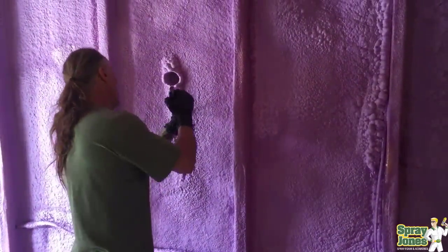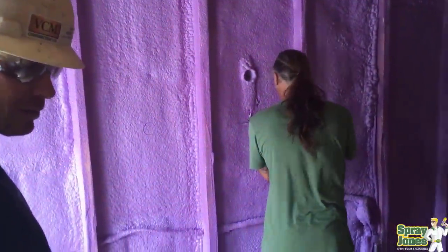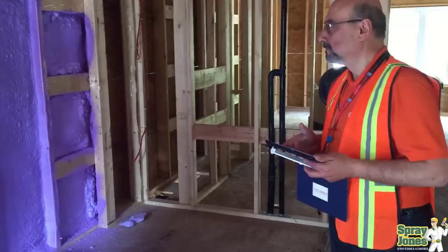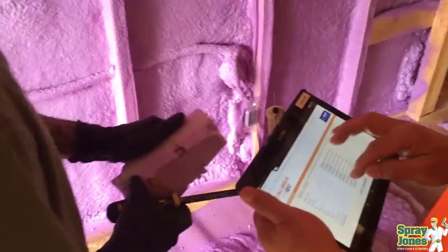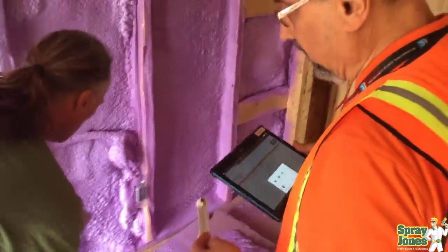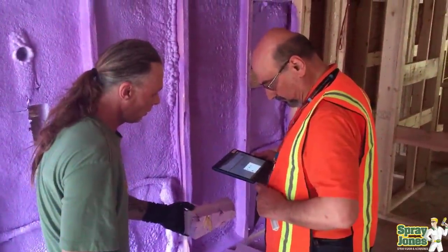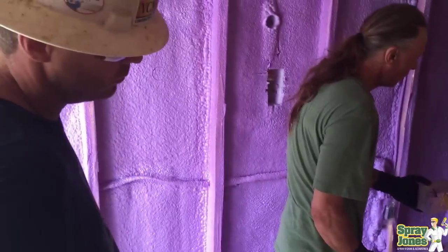As the end user or the person doing it, you need to be testing density via displacement. That means the foam is going to be cut out and they're going to do a core density check — remove top and bottom skins and check what the density is. That's the closed cell foam test. They're not going to do that on open cell because open cell would absorb too much water too quickly and skew the results. You need to do it in a volumetric displacement test.